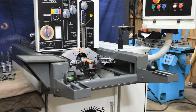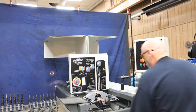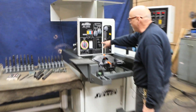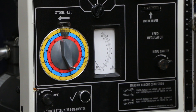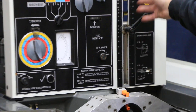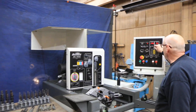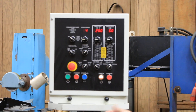What we have here is a modern hone. It looks a little different, but it basically does the same thing. You have your foot pedal that you can press to start going, and as I apply more pressure you can see the analog needle working its way down to zero. You've got the same adjustments for your automatic stroking — the speed of the stroke you can adjust digitally up here with the control, and how many strokes per minute, so you can make it go faster or slower.